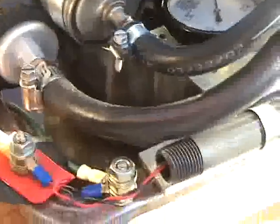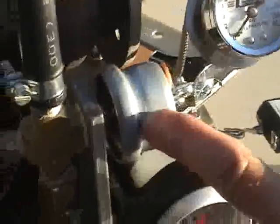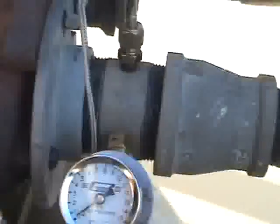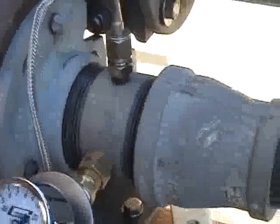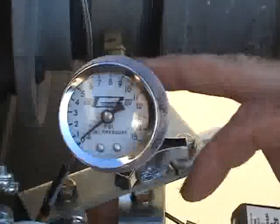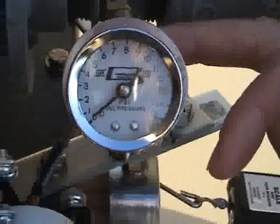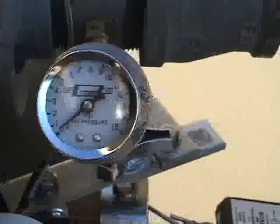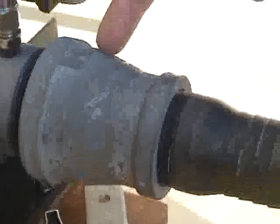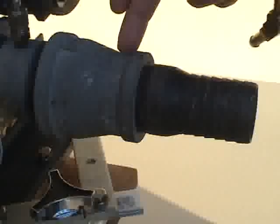This is a gasoline pump that we're using for pumping the oil. This is a cutout switch, yet to be wired up. Two inch plumbing floor flange — one and a half inch in here, two inch floor flange. This is the temperature sensor which is from a turbocharged car. This is the jet pipe pressure meter — actually a fuel pressure gauge that I'm using, with a two inch to one and a half inch plumbing converter for one and a half inch rubber hose.